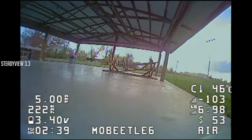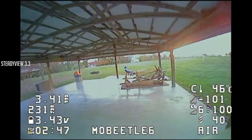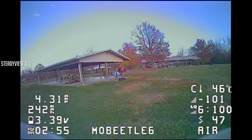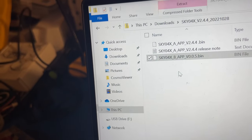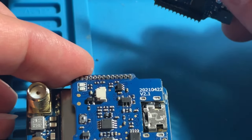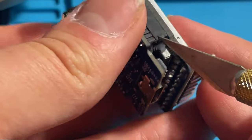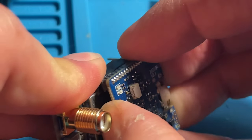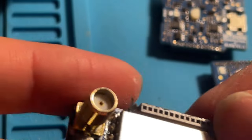There's a cheap, quick, easy upgrade that you can do to fix it. Should they be giving it out for free? I do think so — I really think they should be giving it out for free or a little cheaper. But it is what it is. Better late than never. I do want to talk about how to do the upgrade — I see a lot of people in the groups doing this wrong. You need to upgrade your goggle firmware first, and then don't touch the firmware on the SteadyView receiver. It is already upgraded for you from the factory. Just plug it in. You're going to need to use an X-Acto knife to remove some of the glue on the current receiver to be able to pull the fusion board off. Just go slowly and carefully around the thing. Don't touch that software, don't touch that firmware — it should be just fine from the factory. Leave it alone.